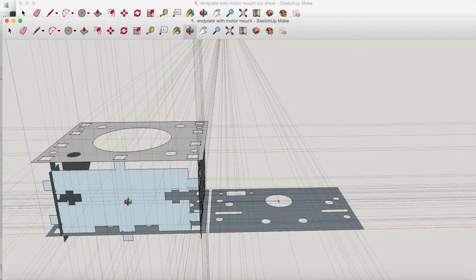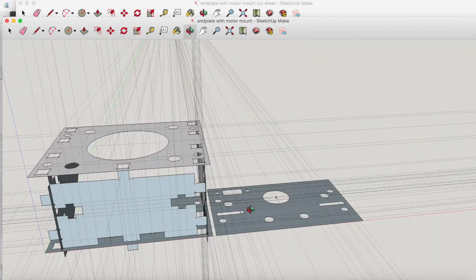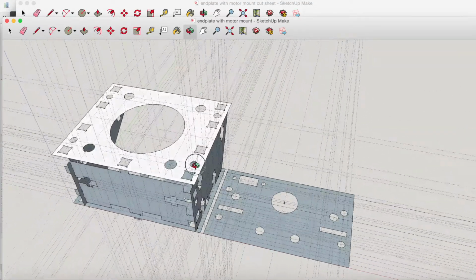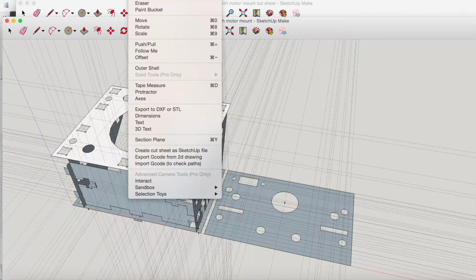Those were the two fundamental ways of creating a 3D shape from the 2D sheet of acrylic. The way that I convert this into a cut path for the laser cutter is using my own SketchUp plugin, which is available to download. There are links in various previous videos if you check out my channel. The way that plugin works is you just go to Tools, Create Cut Sheet as SketchUp file.